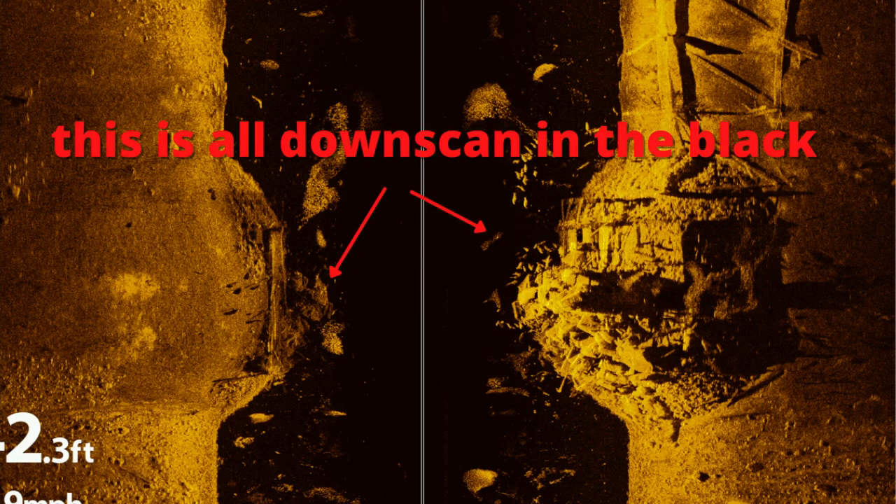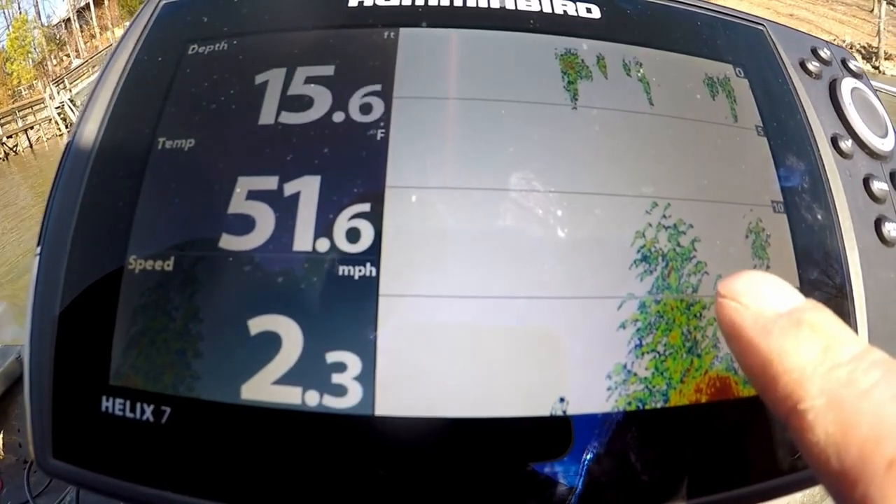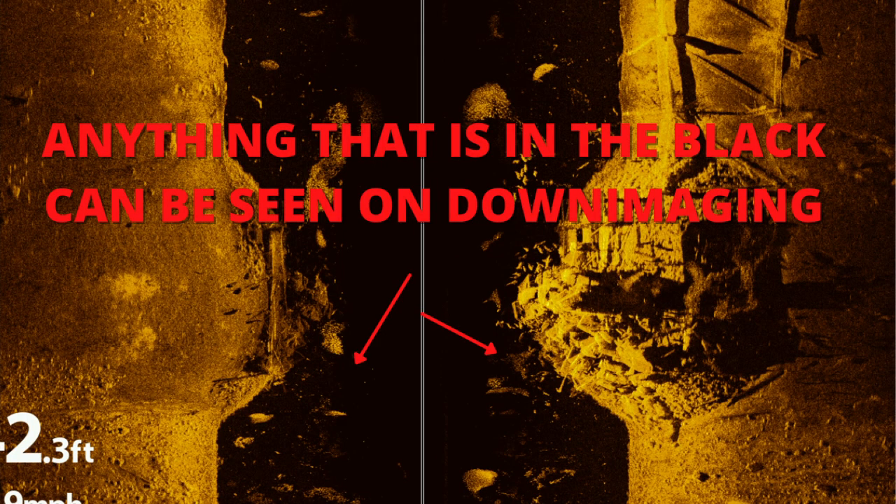All right, this is one thing: if you don't know a lot about side scan, side scan is essentially down scan. On side scan — I'll throw up a picture here — the black areas under your boat is down scan. A lot of people like to run side scan on top and down scan on bottom, but essentially you're losing a lot of screen doing this. When you see something right on those black lines, you can switch your unit to down scan and check it out a lot clearer, then switch back to side scan to have a bigger picture.